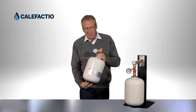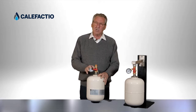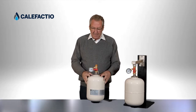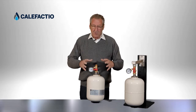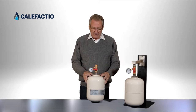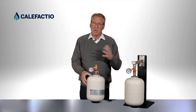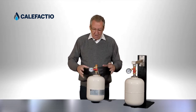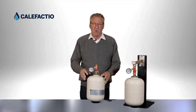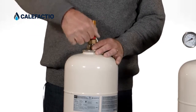I can then read the tank pressure through that small port and see what the pressure is in the house. This is especially important with potable water: if the house pressure — say 60 PSI — is higher than the tank pressure — say 50 PSI — water from the system will enter the tank, become stagnant, and that stagnant water promotes bacterial growth, which you definitely don't want.